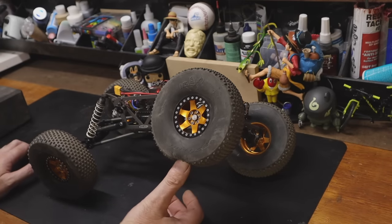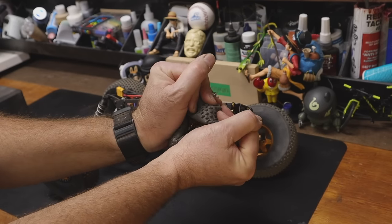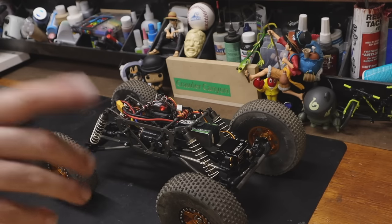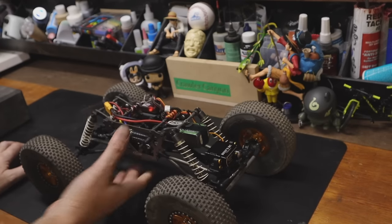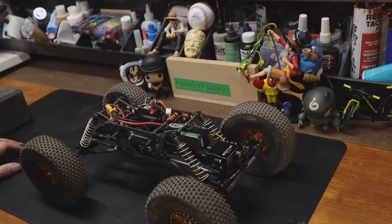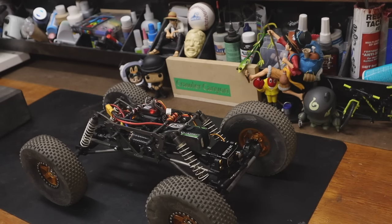And they have the foams salvaged from the Endura Bully comps. So they are, one might say, potentially too soft, potentially. But right on, it's like 4.51 pounds as outfitted right there. So there's really no weight. This is something that could quite easily be made into a lightweight. Half height servo in the front, go down to like a 650 or 850 battery. That alone would save 6 ounces. We'd be very close to 4 pounds.